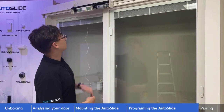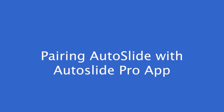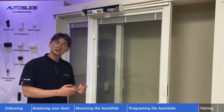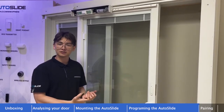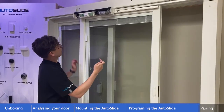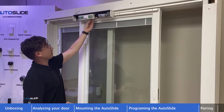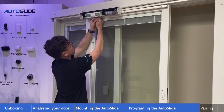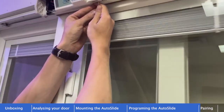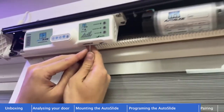In the next section we'll cover how to set up the Autoslide app. Start with the system powered off, door slightly open, all dip switches off except Dipswitch 6 — the 6th from the left or 3rd from the right. If your system is already powered on when you turn on Dipswitch 6, note that it will override your existing physical settings.